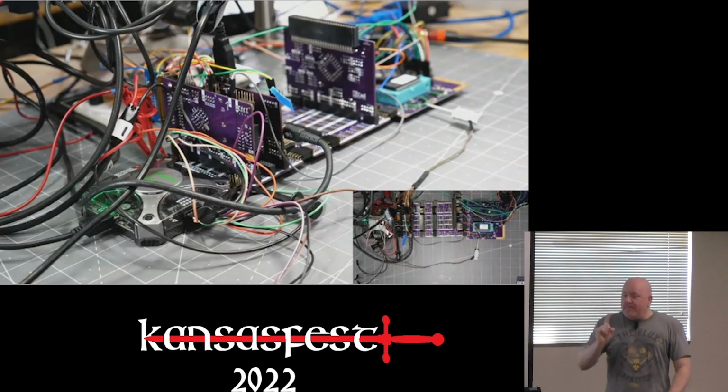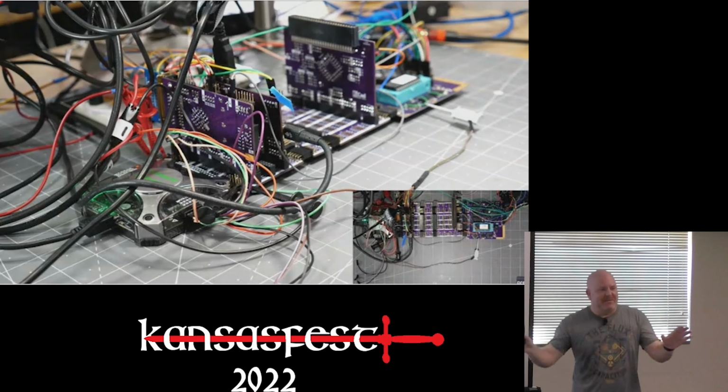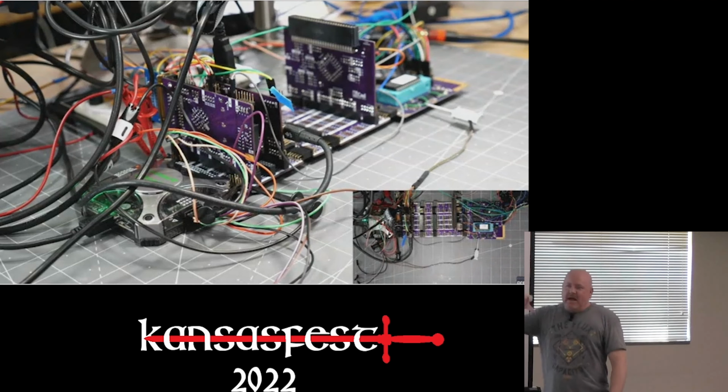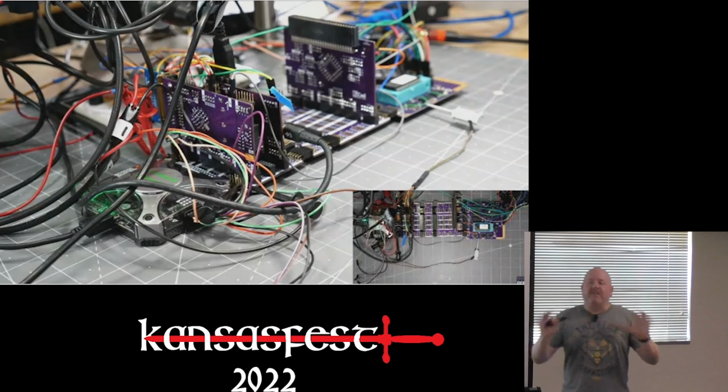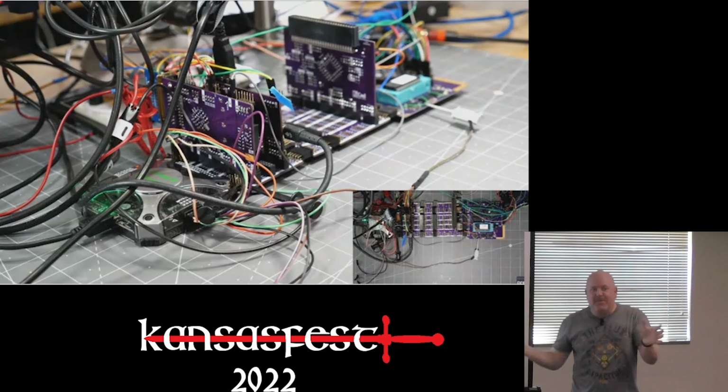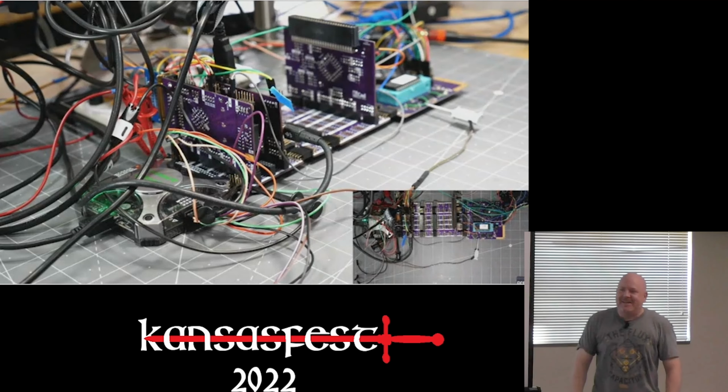Now, the one part that I think was the most clever, like I feel like I've done a lot of things, but this was the most clever thing I thought of: on that backplane, I laid out the connector for the address and data bus so that my Digital Discovery could plug directly into it. No more fly wires, which made debugging significantly easier. Of all the cool things that we've done in this project, that's probably the coolest thing. And it took zero effort, right?